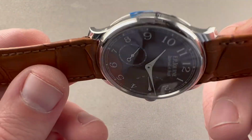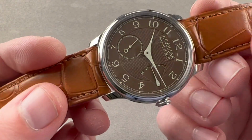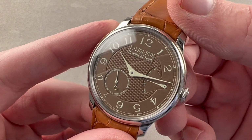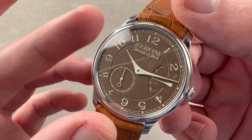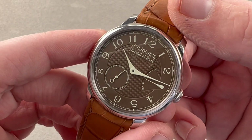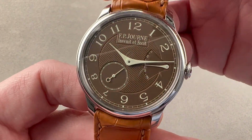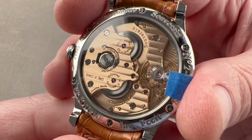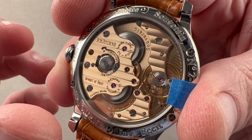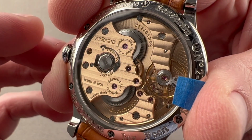In general, chronometers will hide all of their deviation in the crown down or crown up position. Whichever of the two is not being tested, that's where the watchmakers will hide all of the mistakes, so to speak. A 6 position, crown up, crown down, crown left, crown right, dial up, dial down. A 6 position adjusted watch gives inaccuracy no place to hide. That's why this is 6 and a chronometer is only 5.